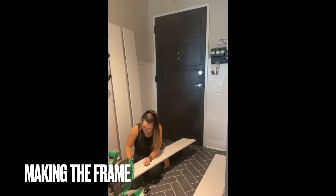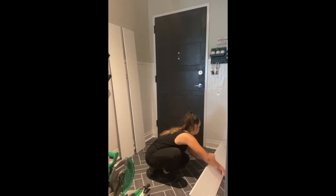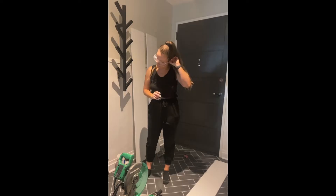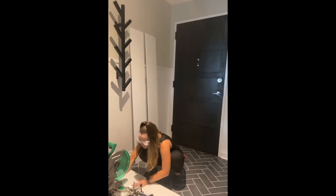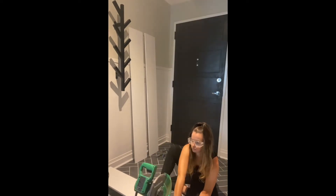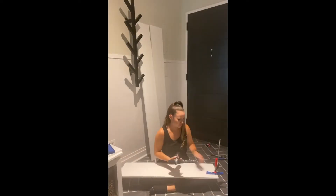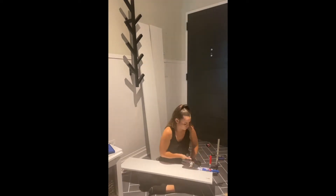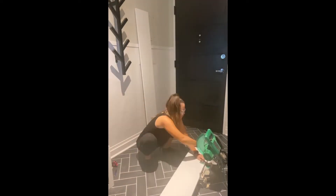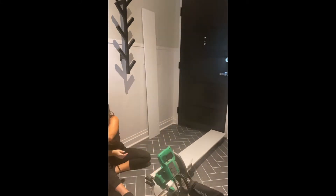After I found the shelves, I figured out what the different lengths needed to be for my frame boards, then used my miter saw to cut them. I ran into a little trouble because the shelves are 10 inches deep and my miter saw is an 8-inch saw, so I had to flip it over and cut the other side. Then I added pocket holes with my Kreg pocket hole jig — I do have another tutorial on that if you'd like to learn more.